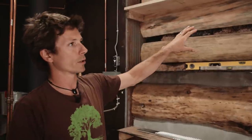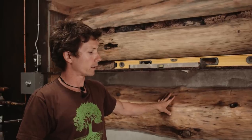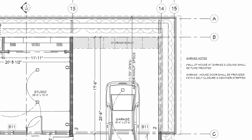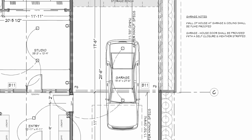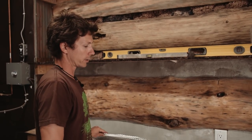In the early stages of building the Earthship we tried this clay plaster — it was a little flaky and wasn't holding well. We were able to find reclaimed logs from a log home building company, which were essentially their scraps, and we got them for fairly cheap. We put them in with two six-by-sixes on either side and then created it with a cement lath plaster, which gives it a good finished look.